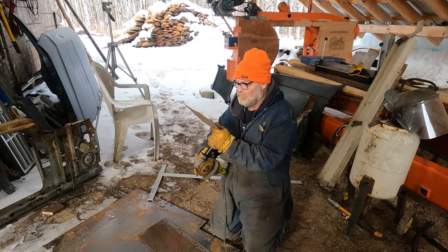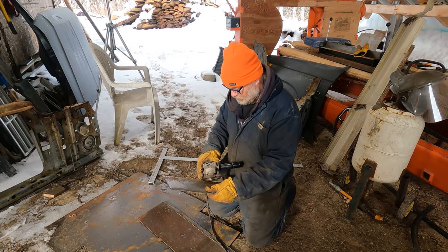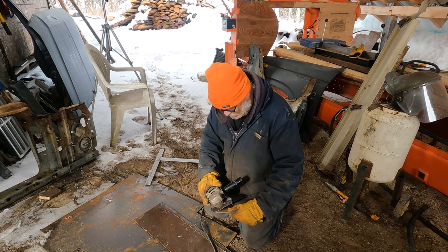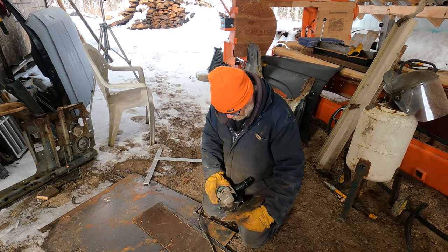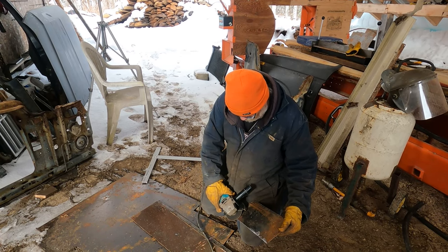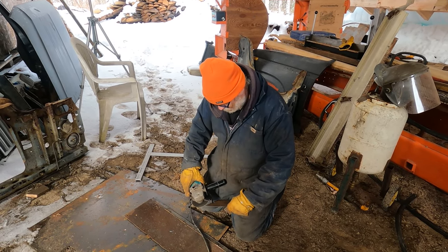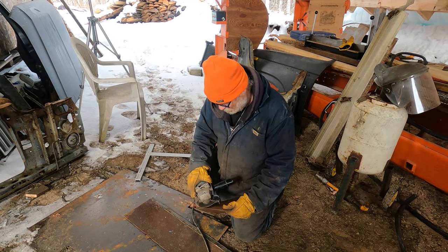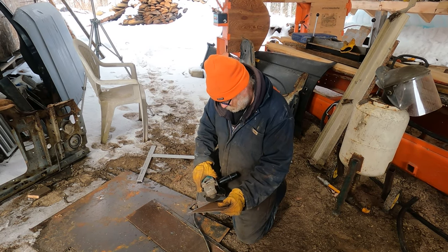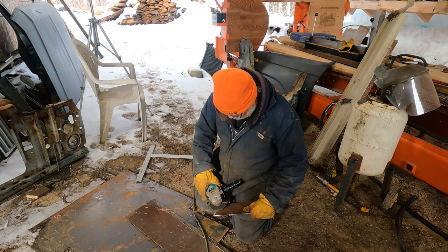And as you can see, it's just an old propane cylinder. That's a 30 pounder, and I just turned it upside down. First, I unthreaded the valve that would normally thread in the bottom section, and I cut a hole. I used a hole saw, three inch, I can't remember now, and I drilled a hole in the bottom of the tank, which is upside down, and that's where I welded in that pipe fitting. The pipe fitting I used to fill up sandblasting sand is just the pipe fitting you would see in your oil furnace tanks that used to sit beside your house or inside your house if you ran an oil furnace back in the day. That's in fact where I got it from, an old oil furnace tank. I just unthreaded it and threaded it in there.